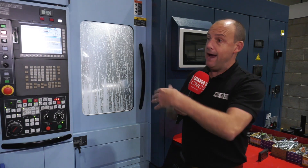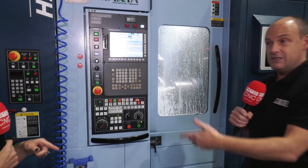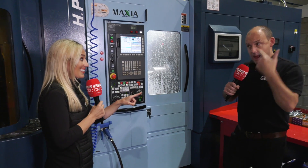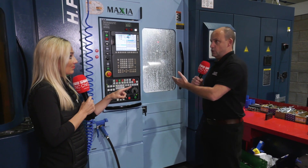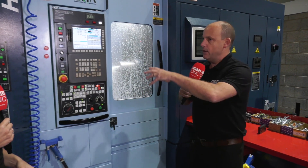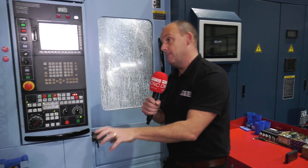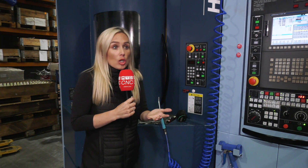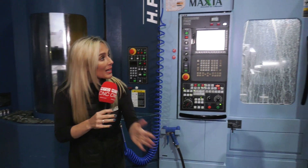The Matsuura RIM software means everything is monitored. Out of hours, the team is remotely informed about what's happening with the machine — run times, productivity, efficiency. The intelligence of the system means that if something happens at night and a tool breaks while doing pallet six or seven, it will move to pallet eight or nine and communicate everything to the control, skipping that job. Previously the machine would just stop and everything you'd planned for the weekend would be gone. Now it schedules everything for you.